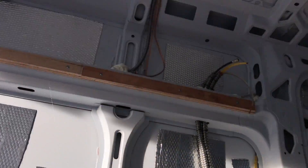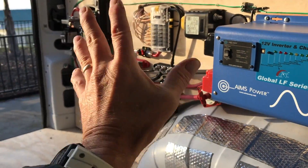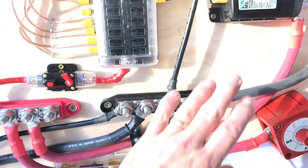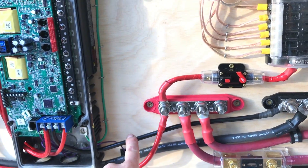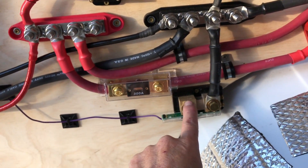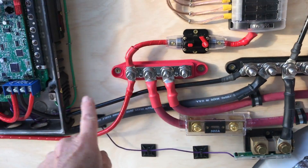The inverter has a way to sense power — if everything else is off it'll just pass shore power straight to the breaker panel. The breaker panel has four different circuits that go into the wall and up to where there's going to be power. There'll be a countertop outlet, a TV outlet, and in the back another countertop outlet and a microwave outlet — so four outlets total. This part is all about AC power and that part is all about DC power. For the negatives and ground, those also run through a main bus bar.